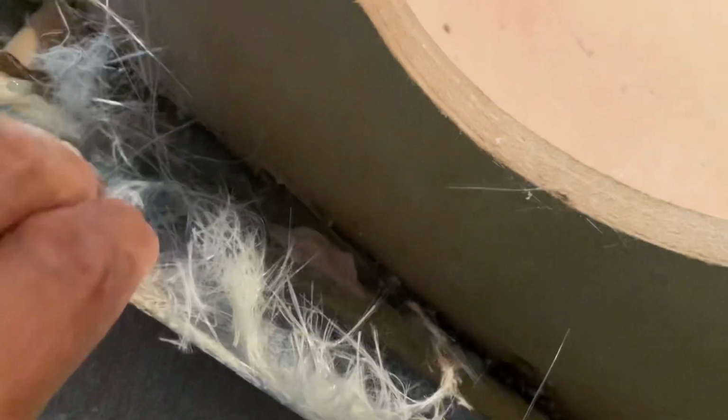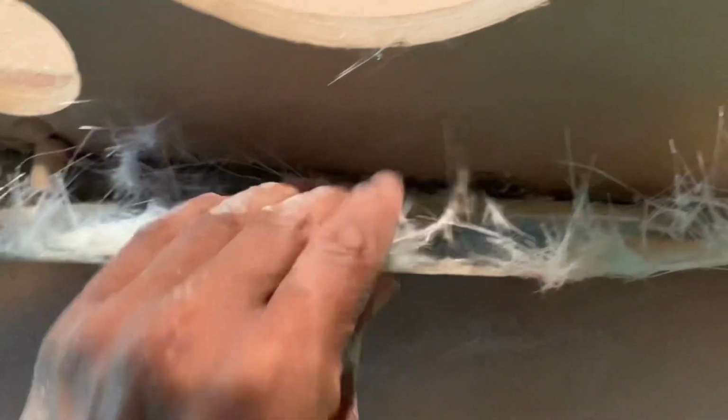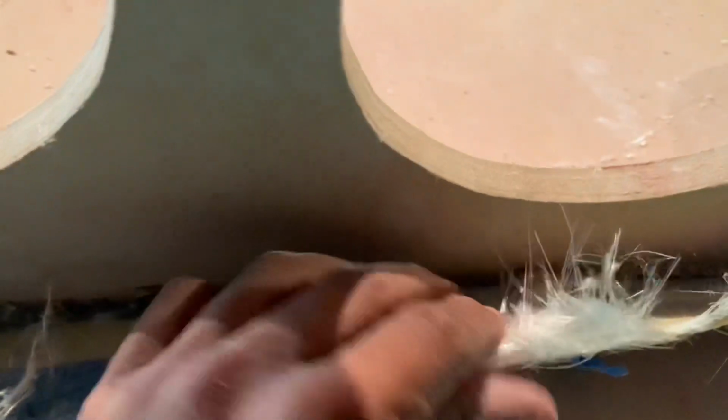All up in there. Now, smaller cracks, like here, all the way around at the bottom, I got mine. Smaller cracks, or like down in here, if you can't see it, don't worry about it. But if you can see the part where your fleece is, all up in here, put some mat in it. And if you cut out and you still got some stringy mat around, don't worry about it. All you gotta do is just tack that down, flip it in like this, and tack it down with the same resin that you're using. That simple. Let me show y'all what I'm talking about.